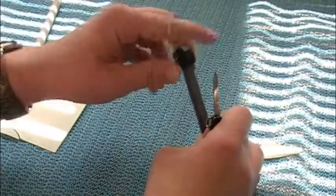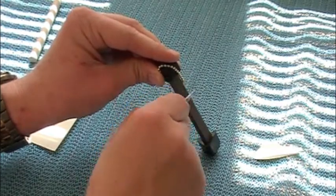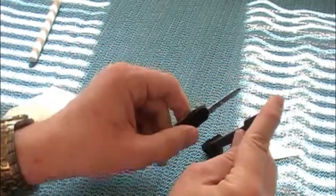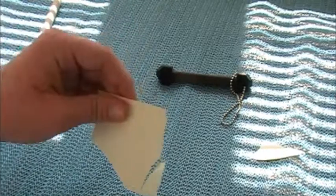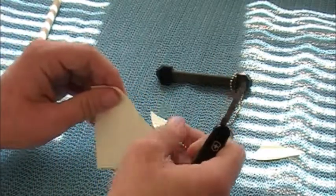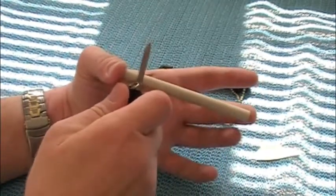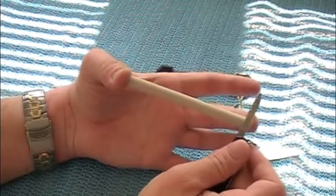Now I'm going to give it just a couple more passes on each side, making sure to use the same angle, going slightly lighter. I've got to use my opposite hand for this. Let me check and see the edge. It's not a perfect edge, but this thing cuts now. So I'm going to move it on to the ceramic stone, which I'm just going to have to hold and kind of work my freehand magic with — and I'm a terrible freehand sharpener, so again this whole process is slightly awkward for me.